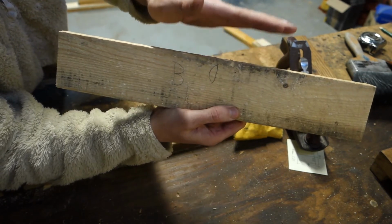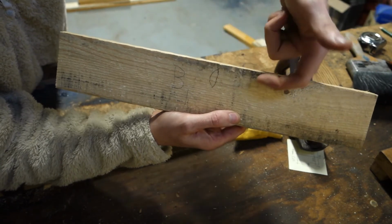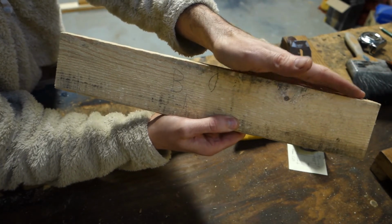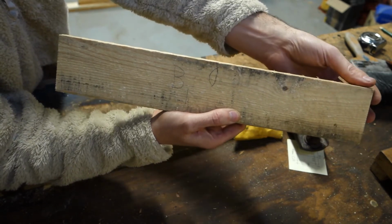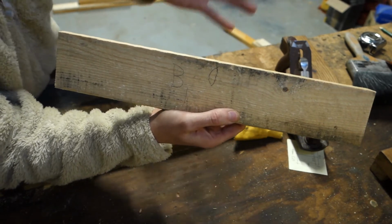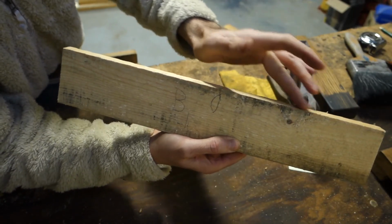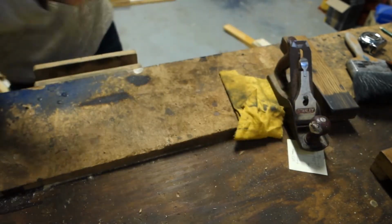So understanding that is that generally, if you always plane the way that the timber breaks to the surface, that way you'll get a nice smooth cut. Sometimes you're just not going to be able to do that, so what you have to do is just plane thinner sections and accept that. Maybe I'll plane this way for this bit and this way for this bit, and hopefully I'll be able to make that quite nice in that little area. So let's give it a go anyway.